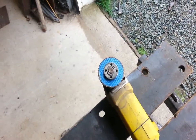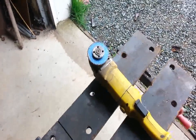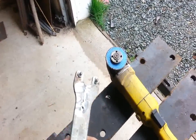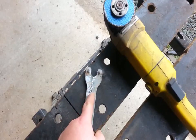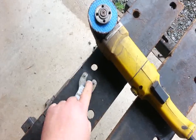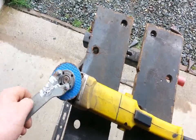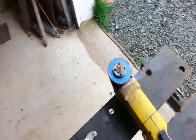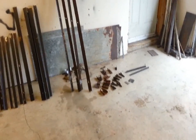The only thing was, I didn't have my tool here to be able to change it. My brother had a loan of it, and I got back the mini grinder, but he still got the tool. I did have this one, but that's a 4.5 inch mini grinder, and this is for a 5 inch, and it didn't fit at first. So anyway, I sliced it down the middle here so far, squeezed it together with my vise, and spot welded it back together again, as you can see, and now it works. So anyway, change over the disc and finish up these, and then we can get started on the project.